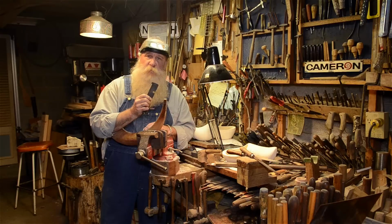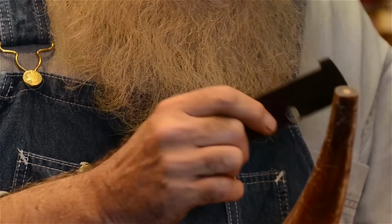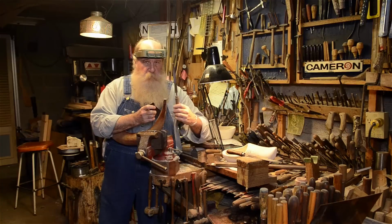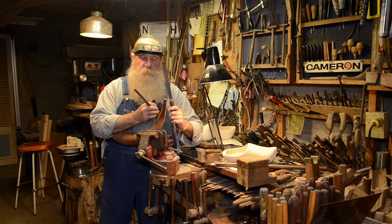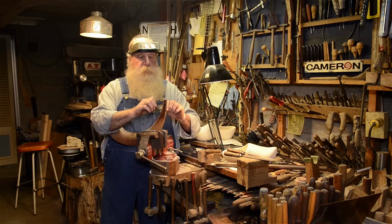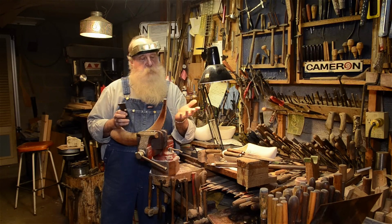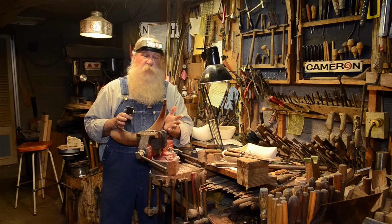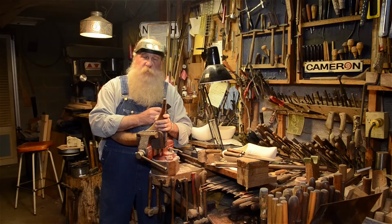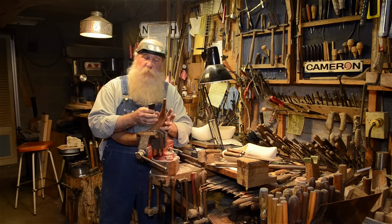And this is all I use typically when I make a powder horn for the rifles and pistols that I build. You can use files, rasps to take off the majority, scrape it to get the finish. Some guys like to use steel wool. I prefer using fine pumice or rotten stone to polish, but I like seeing the scraper marks in them because if you look at originals, a lot of times the scraper marks are still evident.